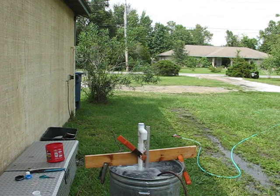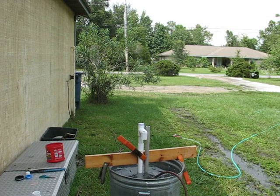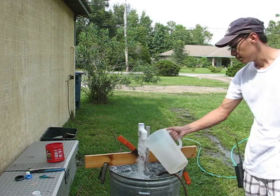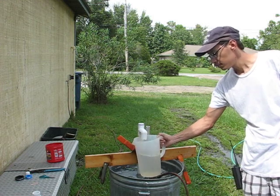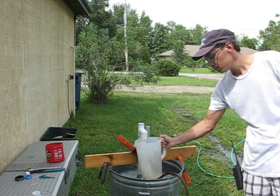The pump is presently lifting water to 18 inches at 10 gallons a minute with just 10 psi of air. So with 120 psi it can lift water 200 feet.